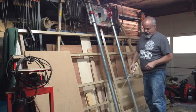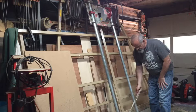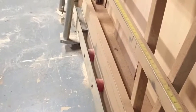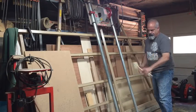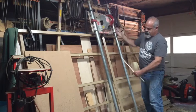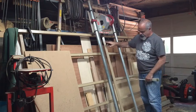It's made up of a perpendicular base at the bottom here with a solid surface here, and then rollers along the rest of the way. These are all adjustable, and it's important that they be perfectly flat. If they're not, then when you come down with the saw and you make a cut, the two pieces of plywood could actually do this and tighten up here.